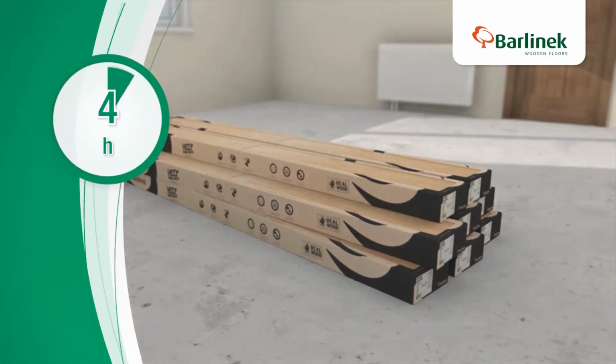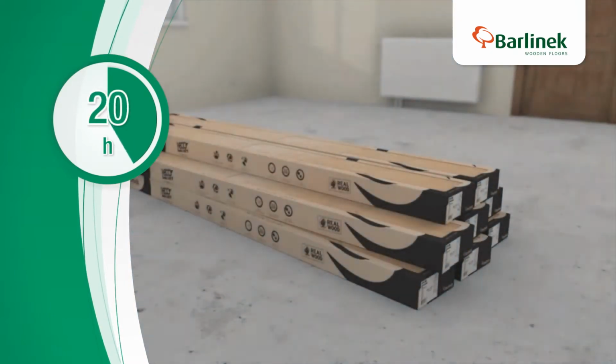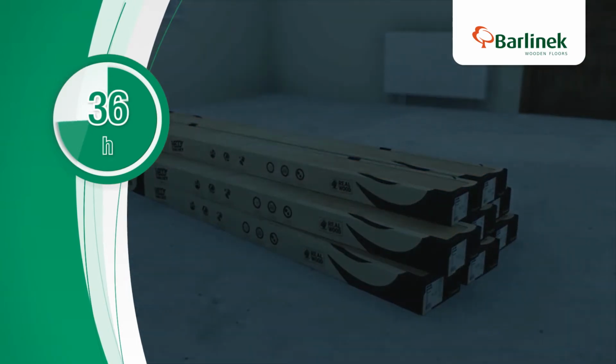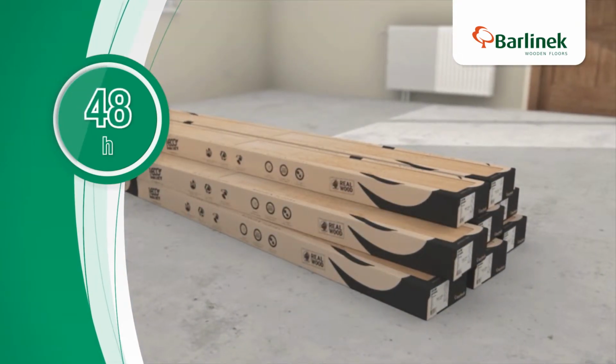Remember to acclimatize the Barlinek boards in the factory packaging in the place where they are to be fitted for at least 48 hours before laying them. During this time, the wood floor adapts to the conditions in which it will be fitted and used.